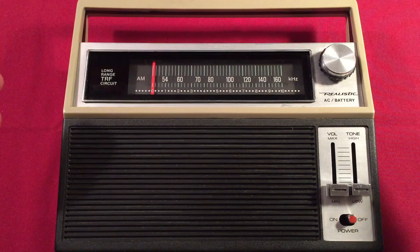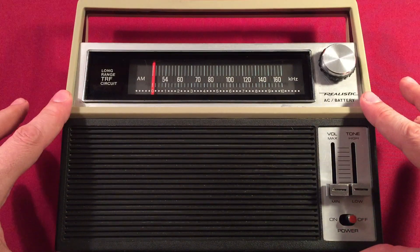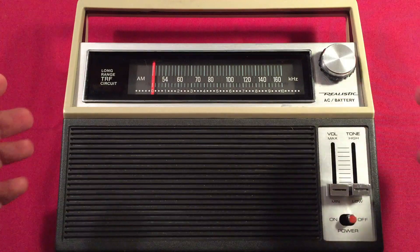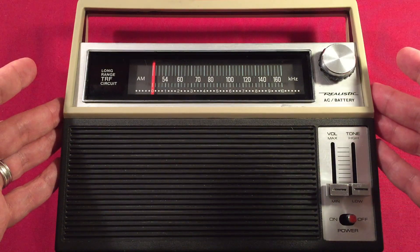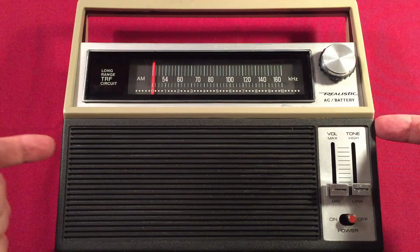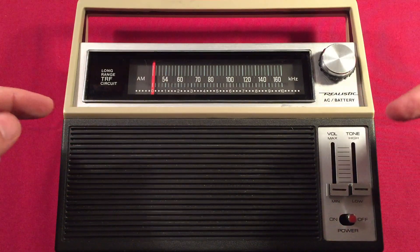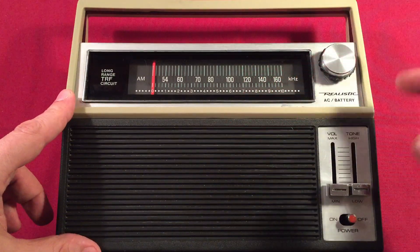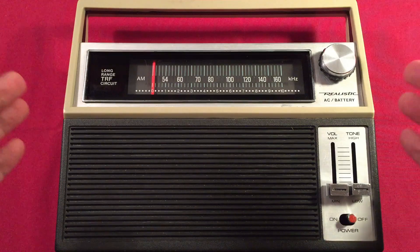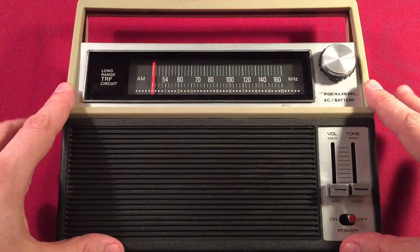So let's talk about this radio. Long-range TRF circuit means tuned RF circuit. Not a lot of radios have it. There's a little tuner for the RF portion of this radio at the beginning. I'm going to have some links in the description to show you what that's all about. There's a full schematic on this guy's website — he has the same exact radio and takes it apart so you can see inside. He's modified it with a different power switch and power supply, but it's pretty much the same radio. He goes into detail about the mods he did, and at the bottom of his page he has the entire repair manual with parts lists, component details, and tuning instructions. When you look at the different stages and the ability to tune this radio, it's amazing.